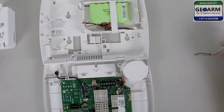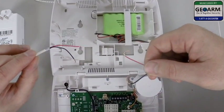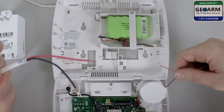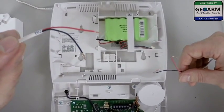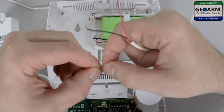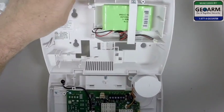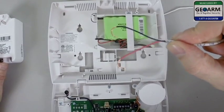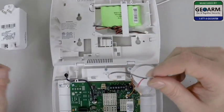I'm going to show you the two different sides of the wires that we have prepared of the 22 gauge by two wire. On this side, more of the conduit has been cut off and I've exposed more of the wire and less of the actual copper endings. This end will be going behind the system. The other part, which will be wired to the transformer — you'll notice I've hooked the two ends and there's more copper exposed.